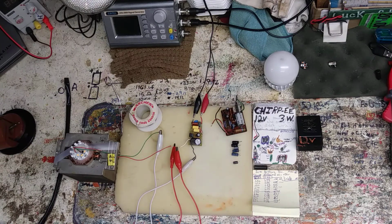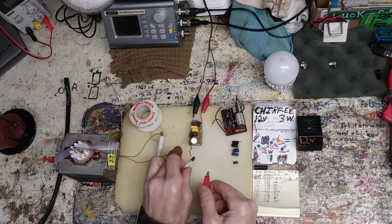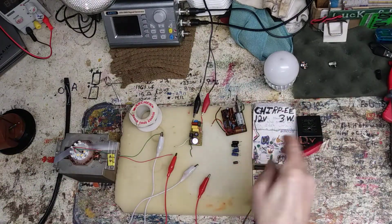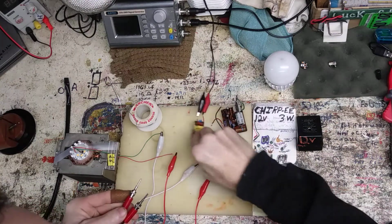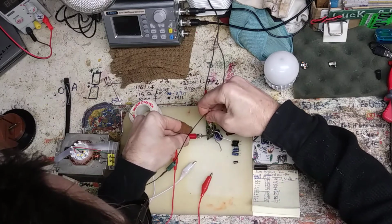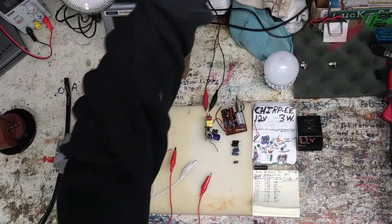I'm going to pull this off of here and test it. I want to get this shut down. I want to drain this capacitor off. Looks like I don't have to. It looks like they do have a resistor in line with it, something drawing it off, because I haven't had any pops yet when I go to drain it. A lot of times you'll see it spark right in there if you got a fully charged capacitor.